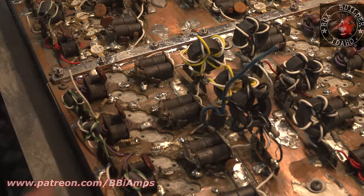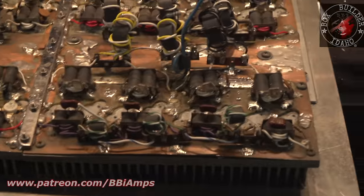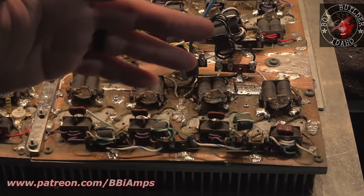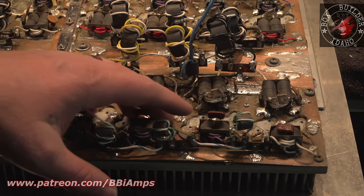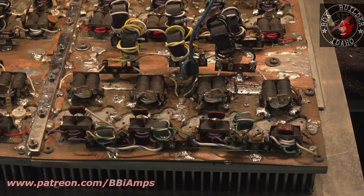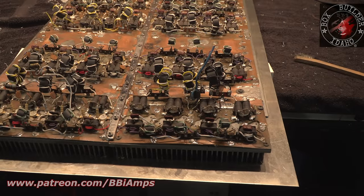And it continues on. So we have the compounding issue of the heat getting distributed out the end of the stack here, and we've got already superheated air, and these transistors are taking the biggest beating. But now we're also going to provide them with the worst electrical connections that we can possibly provide them. You have to think about how the electron energy is making it to the transistors.